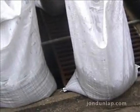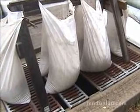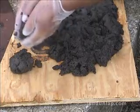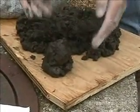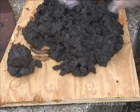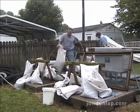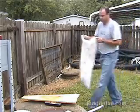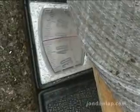At this point, the bags could be refilled or dumped into garbage bags for disposal in the dumpster. The poly bags could be rinsed and reused. We made these shapes to show how thick the sludge became overnight — the sludge is now able to hold different shapes. We converted 800 gallons of three-quarter percent sludge to 600 pounds of 10 percent sludge with an investment of less than $250.